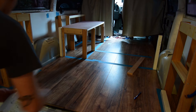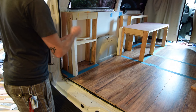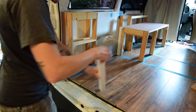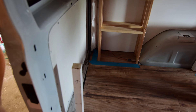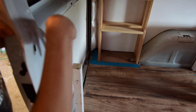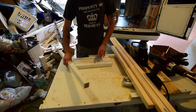Then I've got to measure the distance from there to here. I could build these legs kind of flush with this, or I can move them back. I want the wood that goes on top to go all the way back to here so I have the most room up there, and I need the distance from here all the way back to be half of the bed as well. That actually leaves three inches on the inside with the door closed. I might cut the end piece curved so that pillows and blankets don't fall in. I am so happy with this new jig — all of these cuts are perfectly square.